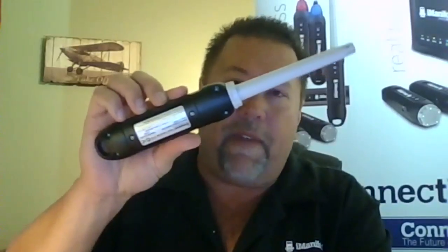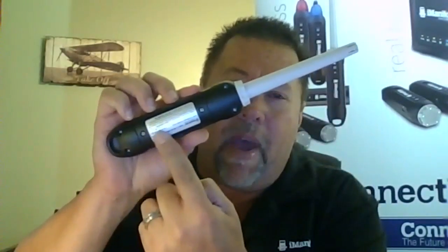And we've got three really strong neodymium magnets in here. So when you put these up, you can always put them onto the face of the register, pop it right on there, make sure your tip's in the airflow. And something else to remember, I'm trying to emphasize this all the time: the sensing tip is on the battery cover side. Make sure you're getting airflow over this tip on the battery cover side. Very important. There's your sensor. These little sleeves enable you to turn the probe around, put it up however you want. Really easy to configure. And you can also use this to hold your flashlight. They are available on our website now.